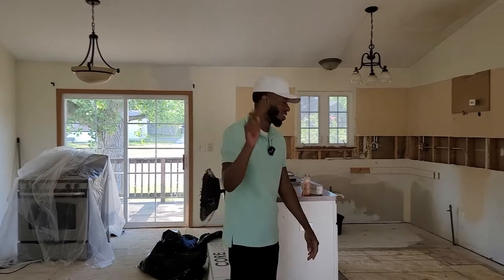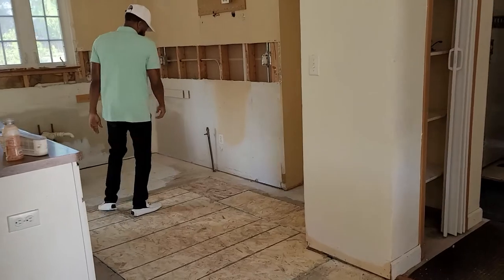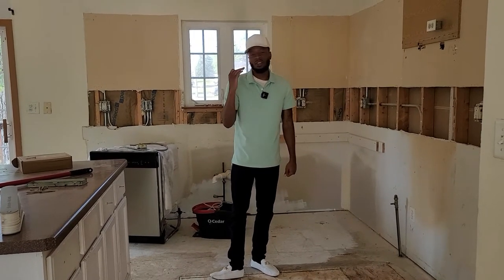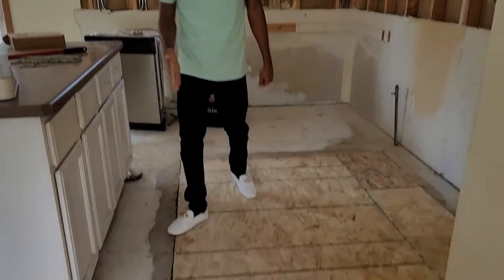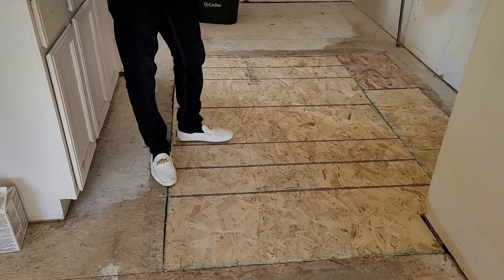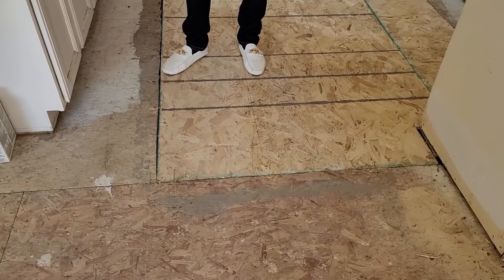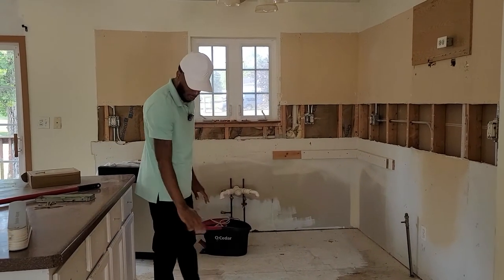Same video, another day. As you guys can see, they got the flooring down. A lot of times with the rehab and everything, we at least try to do it first, and if it doesn't work, then we contact a professional. We did do everything right, but the thing that we did wrong was we had the wrong size plywood. This is 5/8". We had two half-inches, and they have a female or male setup where one piece goes into another piece and then it lays down. That's pretty much what happened. But they got that done — the floor is nice and level.